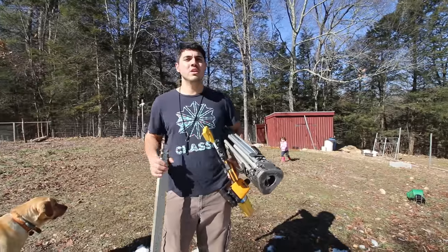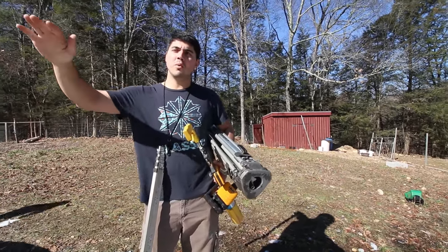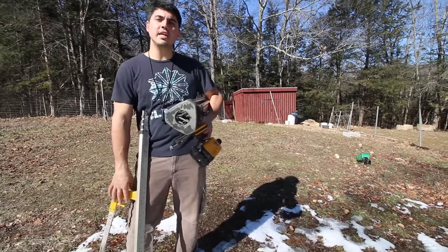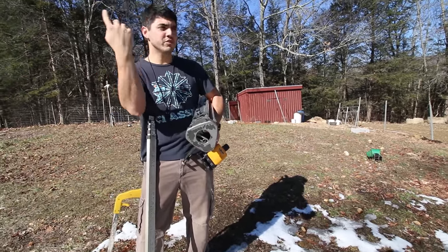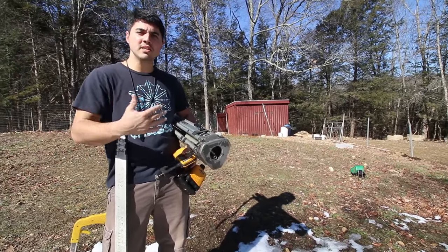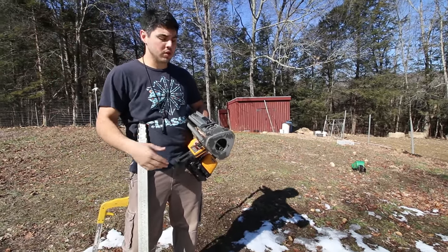This project is going to require us to build our road on grade. We don't want to be cutting too much of this dirt out and we don't want to cut too little. So to establish grade we're going to use the laser. This laser shoots out a 360-degree spinning laser, but when you set up your laser you want to set it up in the middle of your working space. A lot of times they have a specific range and if you get too far away you'll run short on range.